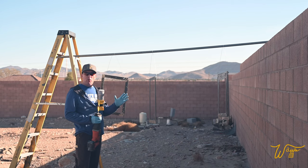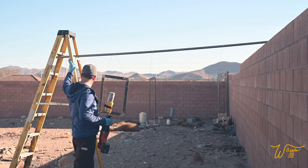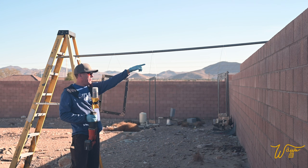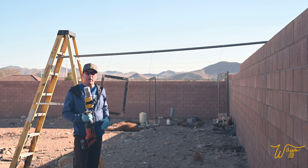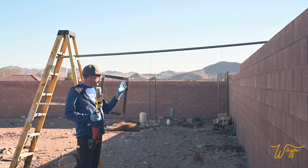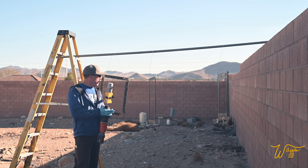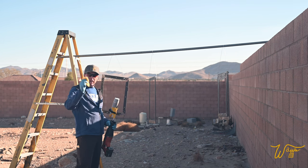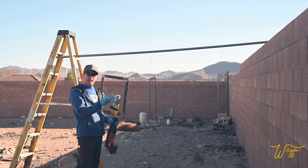All right, I got my little portable paint station set up. It's a piece of conduit with our ladder right near the fence here in the back portion of our yard where we won't get any overspray on any vehicles. Each one of the pieces has been wiped down with acetone or mineral spirits, and then dried off with a tack cloth to try to get any of those little fibers off of there. And we're ready to throw down some paint.